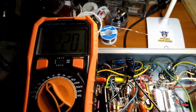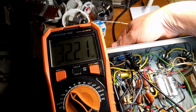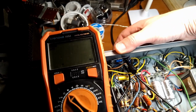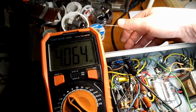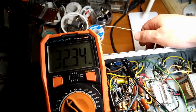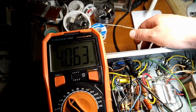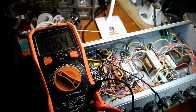But anyway, the switch is in the middle position. We flip it towards the back, we go to 10K, which is Marshall spec. We go all the way forward, we get 4K, which isn't too far removed from the optimal 1.5K bias resistor, which would give you max headroom. And the middle position is 32K, very cold right there. So let's start off at 4K, plug her all back in and do a sound check.